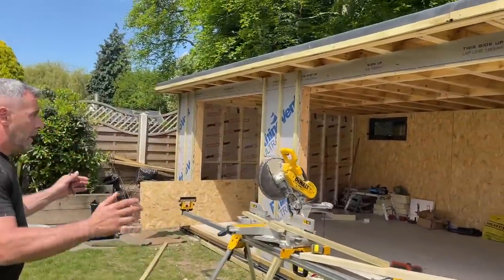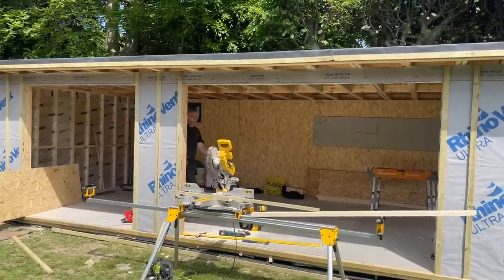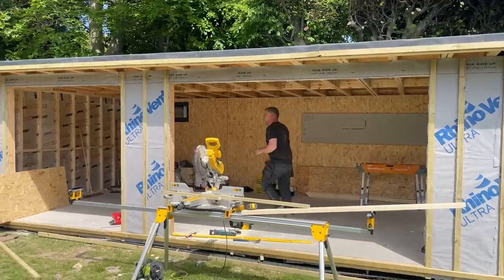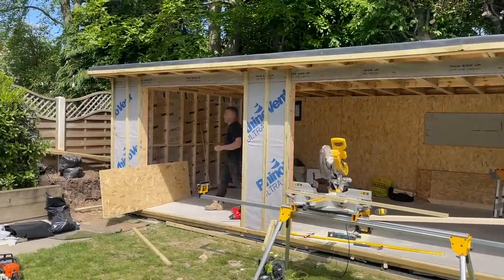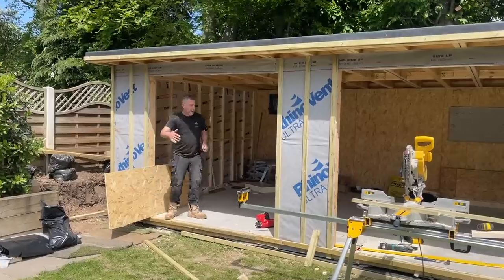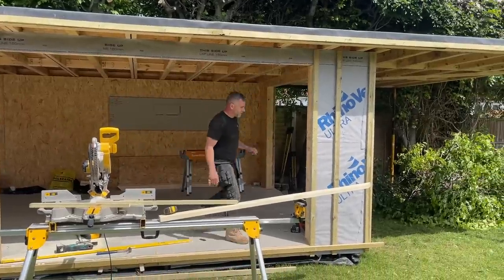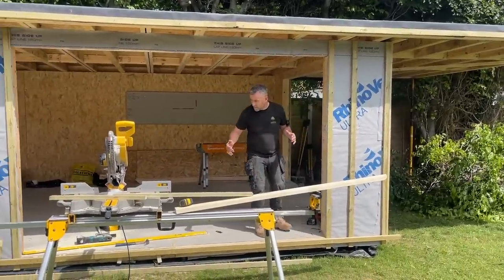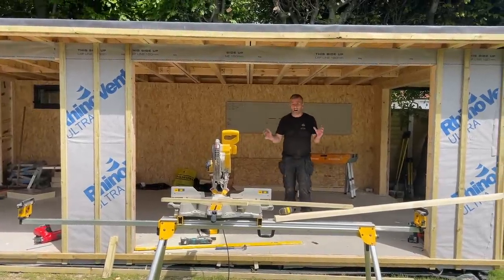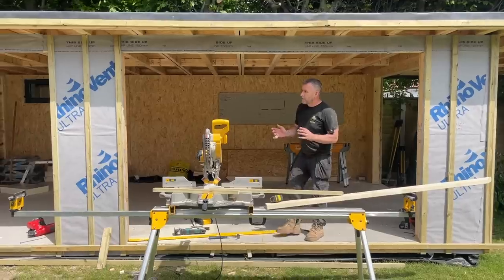If you look at the front of the building, there is a triple window - a pane of glass there, a pane of glass there, and a pane of glass there. They will be non-opening windows. We've also got some sliding patio doors which will all travel that way. What we've been left with is identical nibs which are just shy of 700 - about 680. The nibs are identical, and you've got to bear in mind that all the weight of that roof is bearing down on those three nibs. There's not a lot of timber there to carry the weight of that roof.